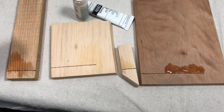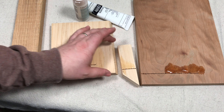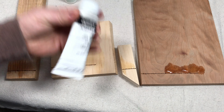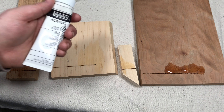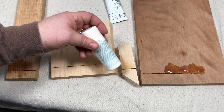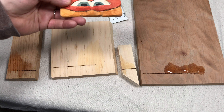Looking back you can see that some things have had some time to move. If you look at that basswood you can see that line I was mentioning before. If you want to paint especially on something like a carving, those hobby paints are really good. The acrylic paints — I don't hesitate to use them, I watered them down real well so you can still see the grain through the paint and it can make for a really nice project. There is such a variety of colors and you can create a palette of paints that you see artists using on their canvases — you can do that on your wood projects.